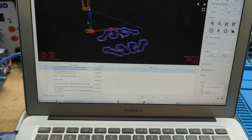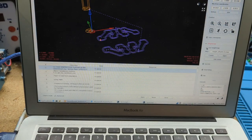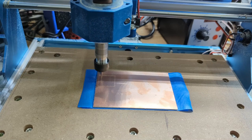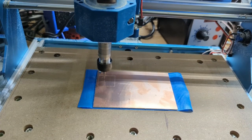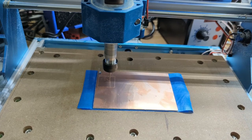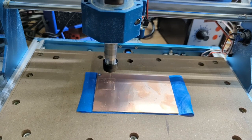Now I'm going to load my actual design. I could run the test again, but it's going to be hard to get information from it because it's already cut where it's cutting. So I'm just going to trust that this is the right setting — I think it'll be high enough that it's not going to break the bit. Use height map 0.15, click send, and watch it start to cut. It looks like it's not quite cutting deep enough, but that's okay — when it's done we can load up the other height map and cut again.